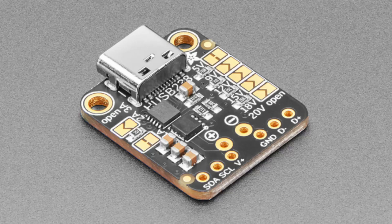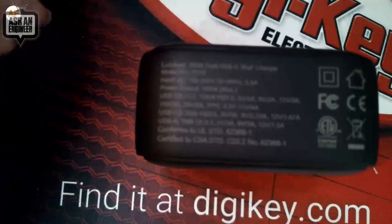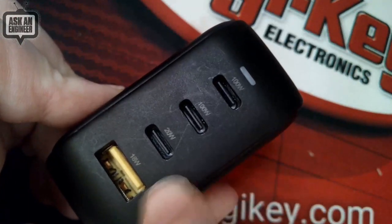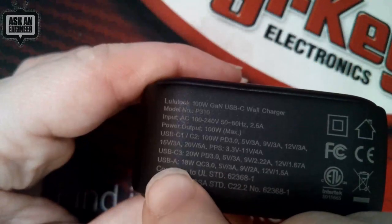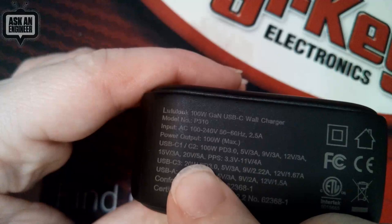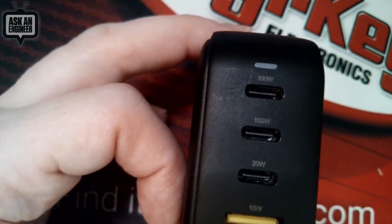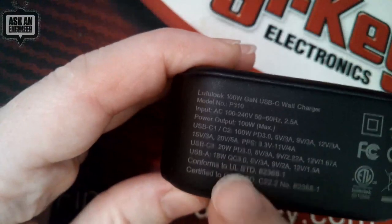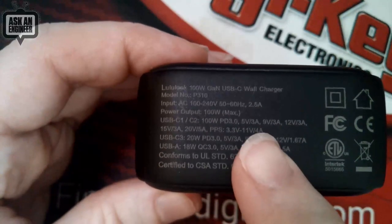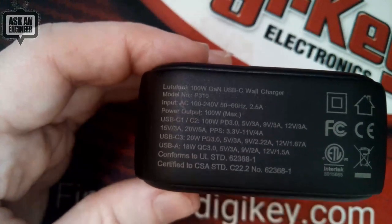Let's go to the overhead and I'll show a power delivery power supply. This is a PD-capable power supply — it can do 100 to 120 watts. On the USB-C port it can do up to 100 watts: 5V 3A, 9V 3A, 12V 3A, 15V, or 20V up to 5A. But if you use a normal USB-C cable, you'll always just get 5 volts. You need a chip that talks to the PD source chip and says 'give me 20 volts' — it won't do that by default.